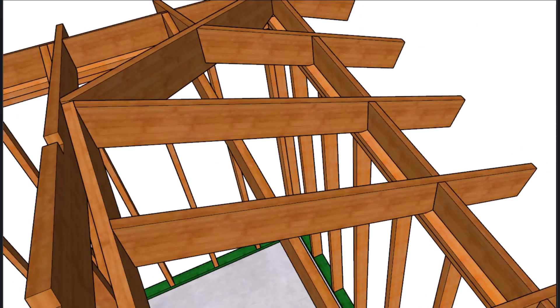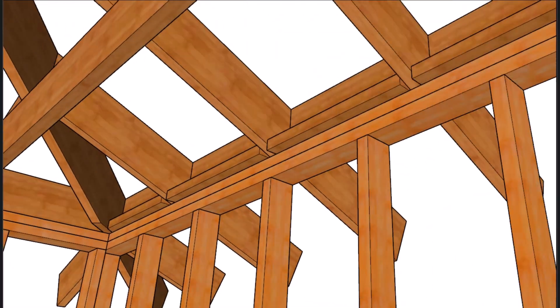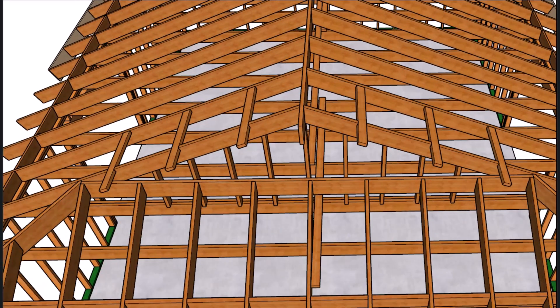Let's take a look at some drywall backing blocks that you might need if you're going to be installing drywall — a common method to create a section of the building you can actually nail drywall to. Just make sure the blocks are strong enough. Most people use screws nowadays, but years ago when I would install these blocks and then nail drywall nails into them, I would often move the blocks as I was hammering, especially if I hit a knot. So make sure they are firmly secured.